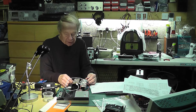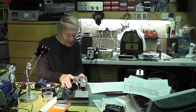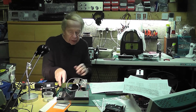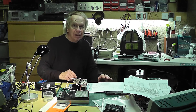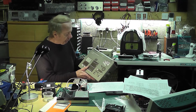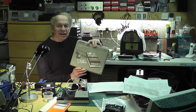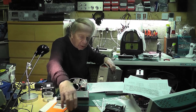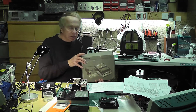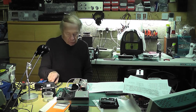So I'm powering it from its own little power supply but I will test it with batteries a little bit later on. The Philips EL3302 cassette recorder - it's a nice machine and all the pieces are with it. Got to get it all back together. It doesn't need a clean up as it's in more or less perfect condition. Why that dry joint happened I don't really know, but it's now sorted. A little warning with these machines - there are lots of versions of the Philips machines, at least two different PCB versions, and I think about four different variants of the actual circuit itself.